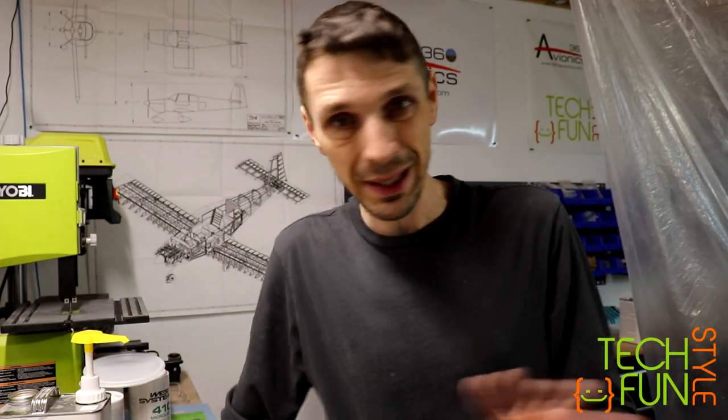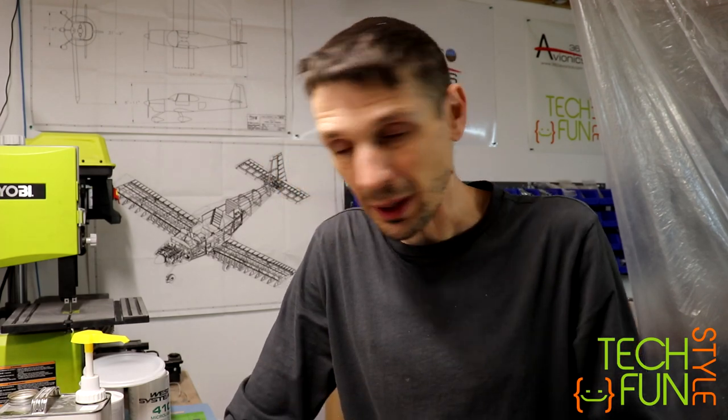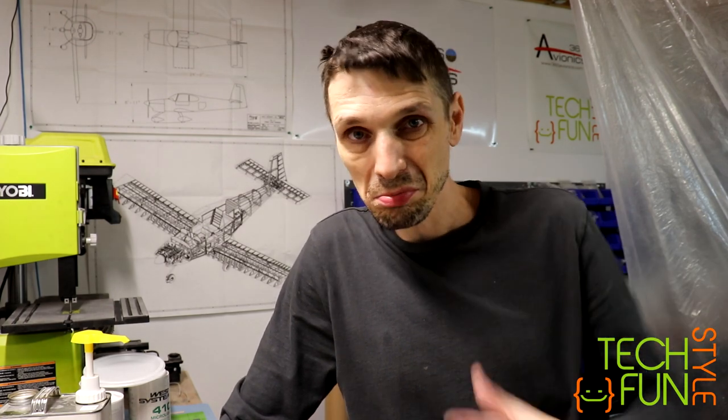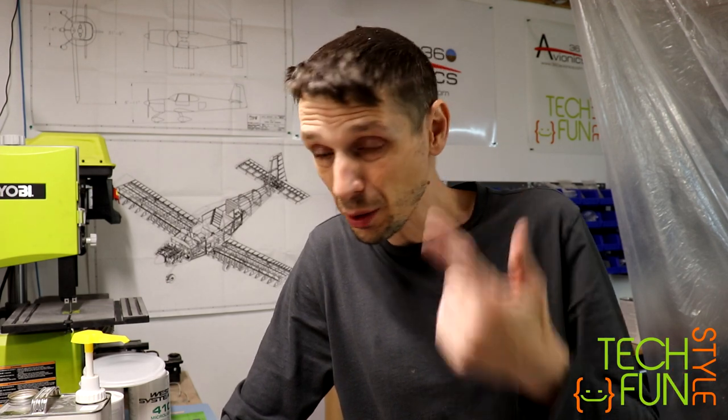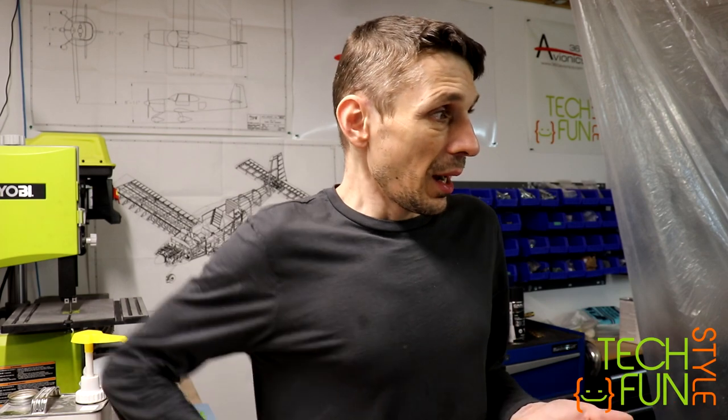So why did I use automotive body filler on XPS? I don't know. Stupid idea, bad idea, don't do it like that. We have perfect products. Well, I use West System epoxy resin with those fillers, and that works way better. Maybe just because I had some automotive body filler, which is lightweight and good, but I totally forgot the base. It's not the epoxy resin base, and it definitely burns the foam.